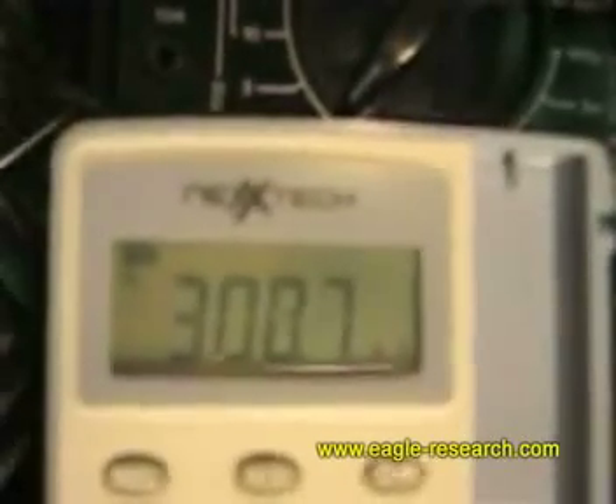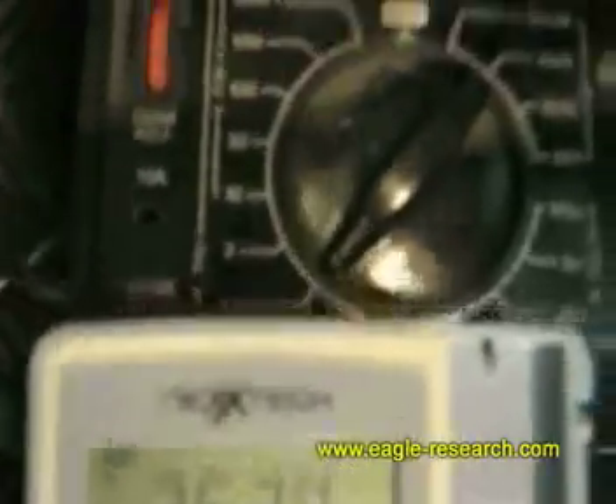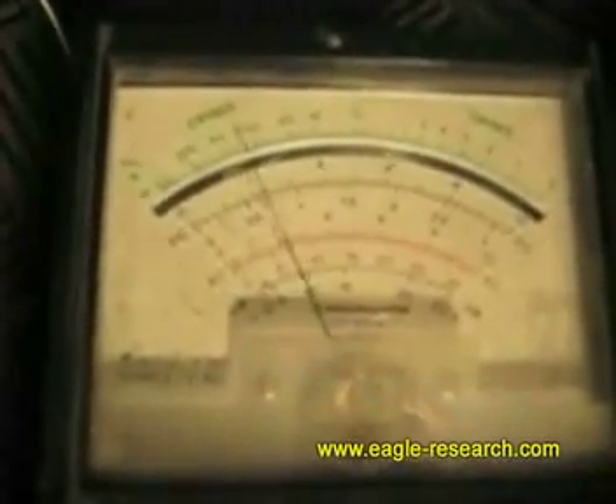Now we're going to raise another 50 millivolts — so that's about 350. We're seeing the oxygen sensor starting to not wave as much; it's starting to stay down. That means the computer is leaning the mixture. And if it leans the mixture too much, you've got to keep finding the sweet spot, and the computer will gradually correct for it.